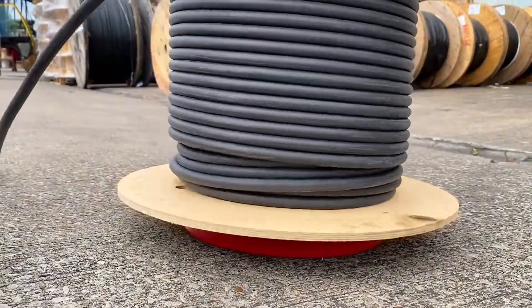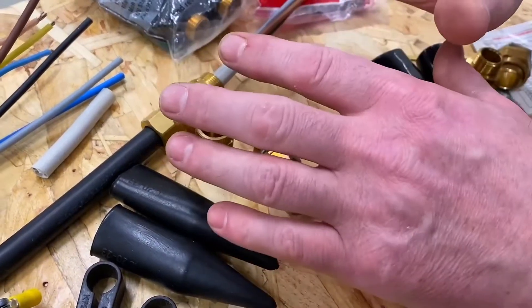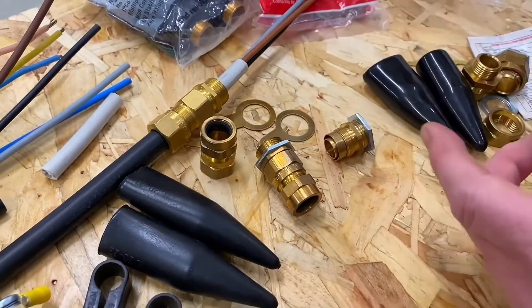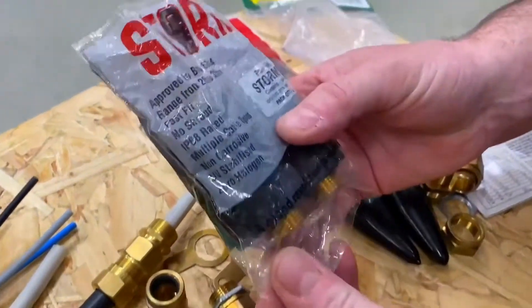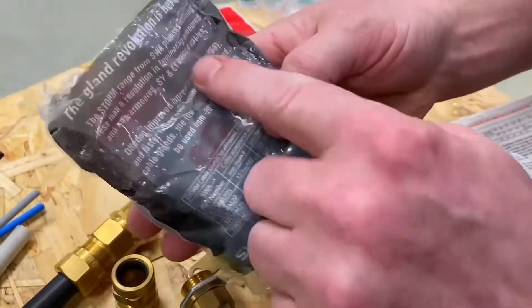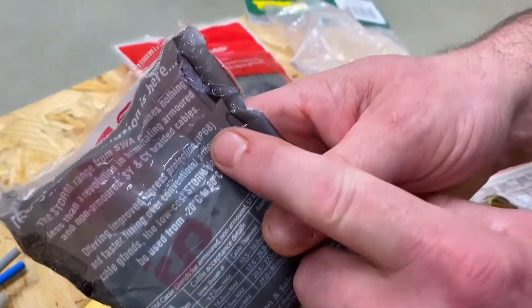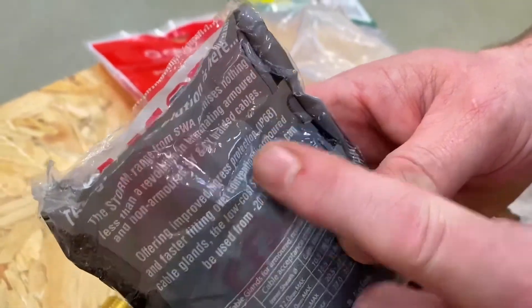In college you're likely to be working with a BW 20/20S gland; you might use the CW ones in a stretching exercise. When you get onto site, you might have a purpose-built gland for outside environments. Here's one with an IP rating of IP68, so we'll have a quick look at this style of gland.